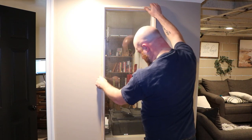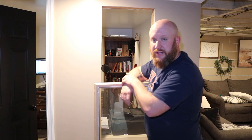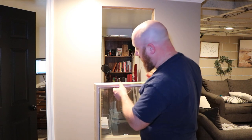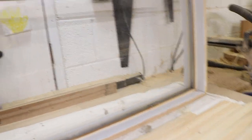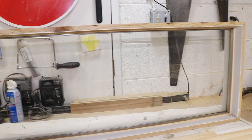There's a little bit of rubbing on the top — I can tell I've got some drywall on the other side that isn't going to hit, so I'll just pull it out. Doesn't look like it's anything too major, so I'll work at cleaning that up tomorrow. Right now I'm going to go ahead and mock up some of the trim pieces — it's just going to be pieces of quarter-inch thick wood, maybe one inch wide — just enough to hide the edge of this three-quarter-inch wood and the edge of the drywall. The window was a little tight getting in, and once I got it in and forced it, I realized I missed something: on this window we're going to put little faux panes in it. I'm going to put a piece of wood right in the center lengthwise, then split it into three sections.